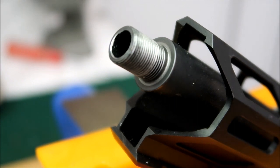I've seen this particular crown job done with the brass screw before, and they had a much more pronounced crown in smaller caliber rifles though. And also I think it was because those particular barrels were a much softer material. This thing is very, very hard. I'm gonna have to research it and see what it is, but I think what we've done here is gonna help us out quite a bit. We'll just have to see.